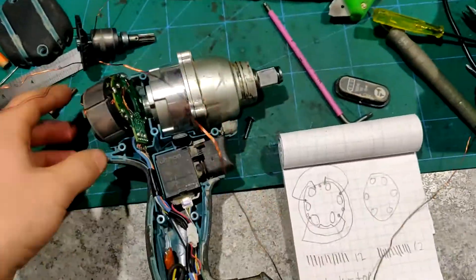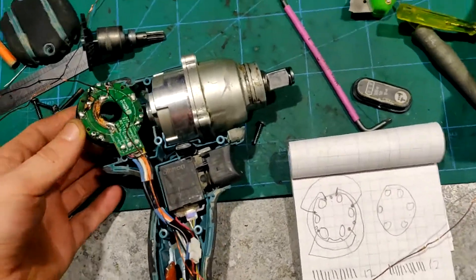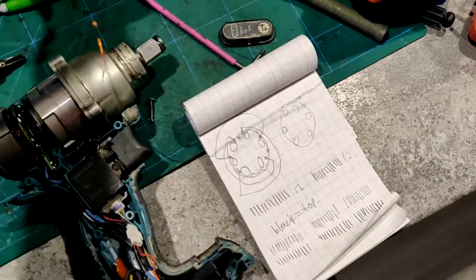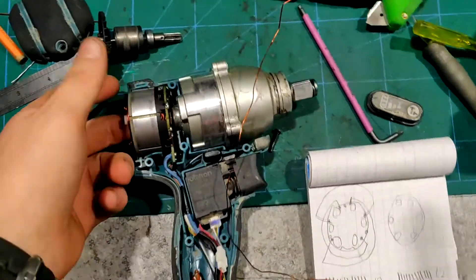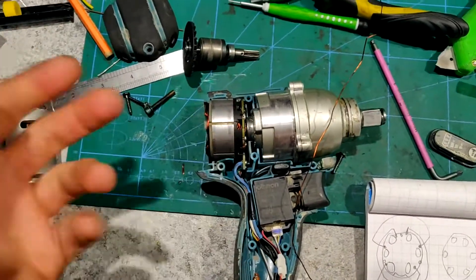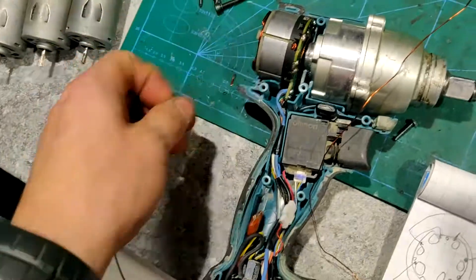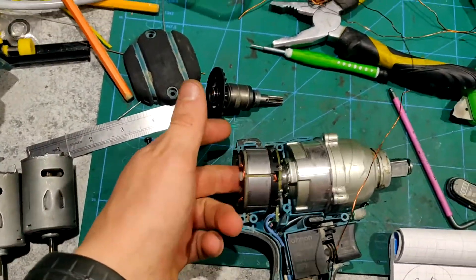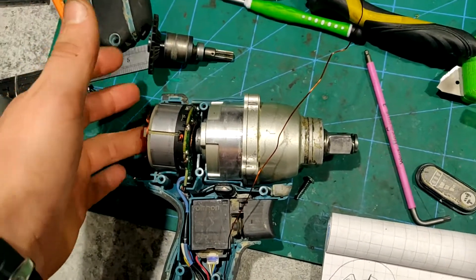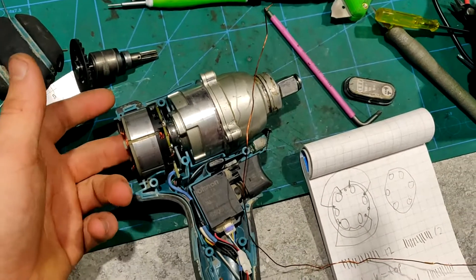So I took two layers of this wire and went around — it took me probably three hours to rewind this and solder it back on. I tested it and it works. The only caveat in taking wire from a DC brushed motor and reusing it is that you'll get nicks in the enamel coating because some of it's glued together in the rotor. So you might have two adjacent windings that short out, but I got lucky and the exposed parts laid out just nicely in the stator.